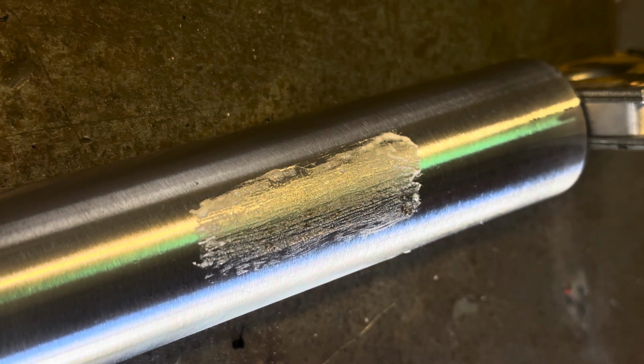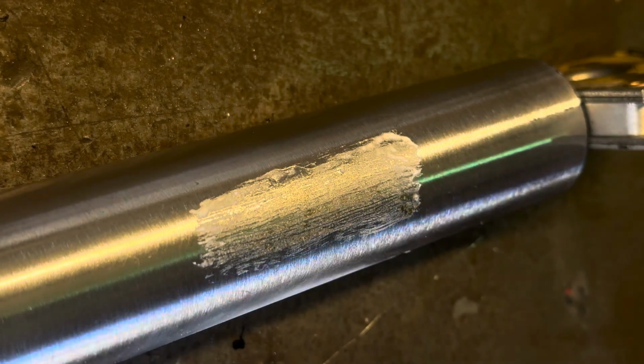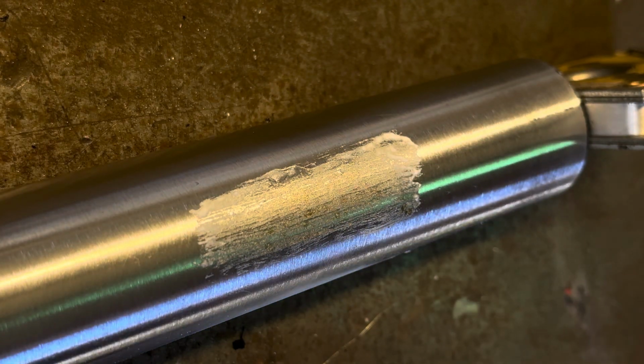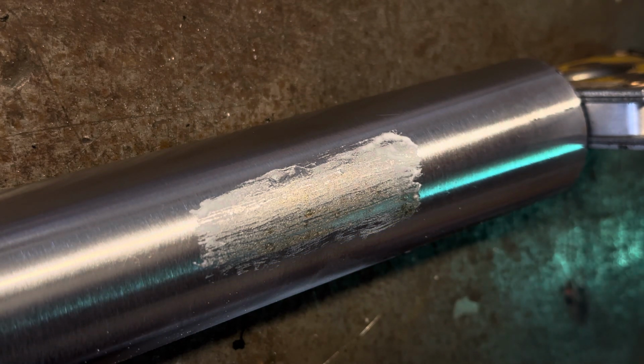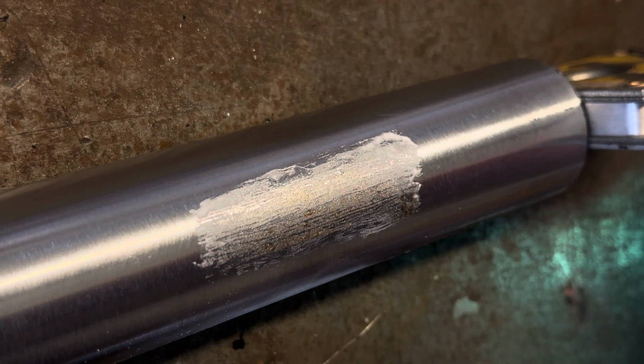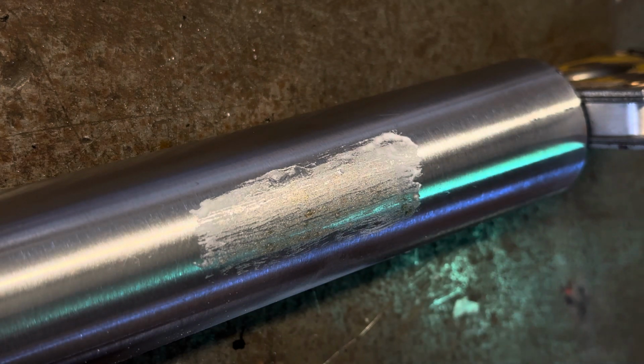for bicycle tubing is that I think it's a little bit heavy-handed. It's tricky to get the edges to wet out nicely, and one of the great things about fillet brazing is that you can do it in a way that is really gentle to the tubing, and the tubing that we use is really thin. If you then go and stick a massive lump of bronze on there, you might be doing more harm than good. You need to have nice smooth transitions to complement the tubing.